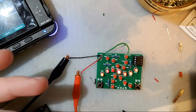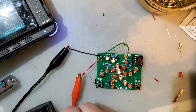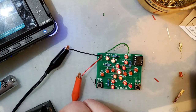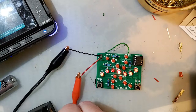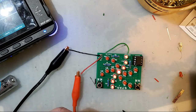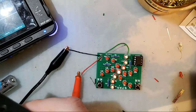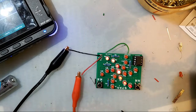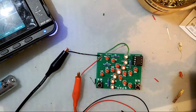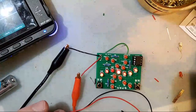Teddy's question is, how do you get tabs on? Teddy, you cannot solder tabs to a battery. That's how it works. If you have a spot welder, you can attach your own tabs that way. If you do not have a spot welder, you can build one, but they're not exactly cheap, and it's not exactly an easy DIY. If you just need a couple tabbed batteries, just do yourself a favor, go on DigiKey or Mouser and buy yourself some tabbed batteries. Yeah, LTT did a video on it. It is definitely possible to DIY, but you cannot solder.